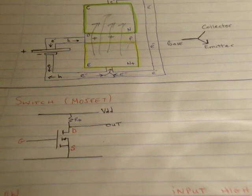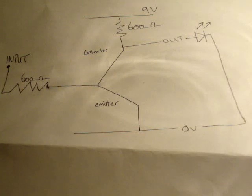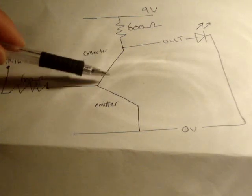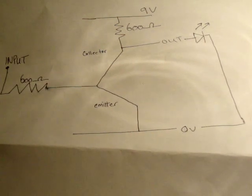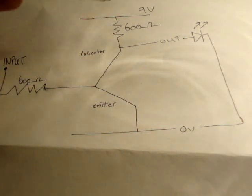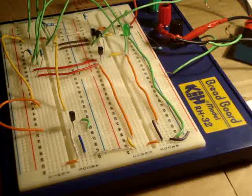I said I'd show you a physical setup of a transistor, and that's what I'm going to do now. Here's the circuit diagram I'm going to use. Here's my BJT — we have the collector, emitter and base. You always have a resistor in series with your base to limit the current flowing into it, otherwise you'll break it. And you always have a resistor in series with your collector as well for the same reason. I'm using a 9 volt input, and this symbol here is an LED which will be my output.